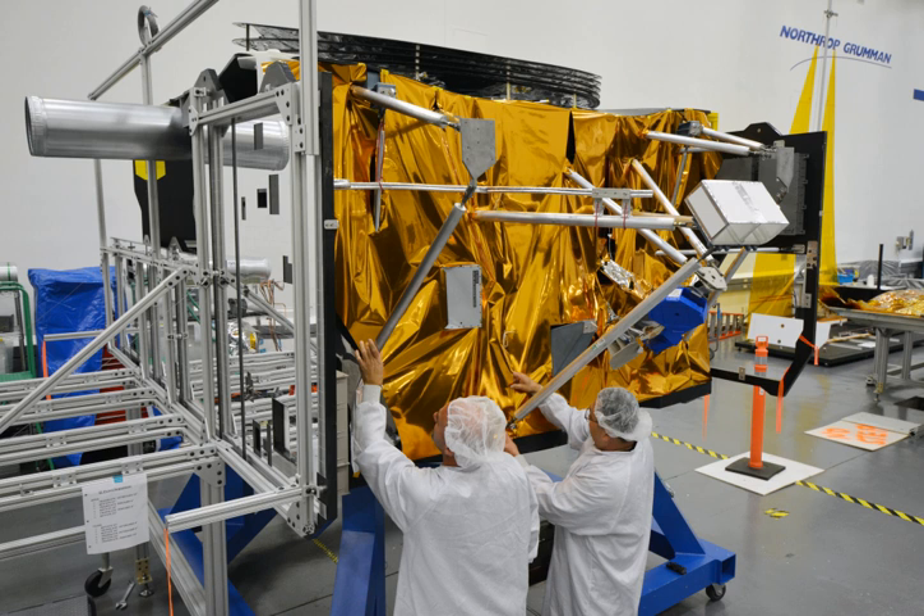The PCU, power control unit, consists mainly of electronic switches that turn each science instrument or support device on or off under control of the central computer. Each switch allows power to flow to its selected instrument from the SAR. Communications with the central computer is via a 1553 bus. In addition to the power switches, processors for the SAR MPPT algorithm are located in the PCU, along with some telemetry processors, processors to detect when the spacecraft has disconnected from the launch upper stage, and some cryo-cooler controllers.